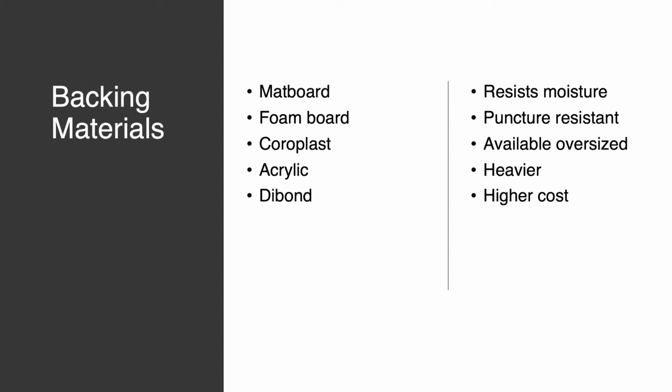It's very useful if you're using an old frame that's not very sturdy or a narrow frame that needs reinforcement. You can cut it or have it cut slightly smaller than the outside dimension of the frame and screw it onto the frame. This will unite the frame, adding strength. Like acrylic, it will also add cost and weight, so be sure to take this into account.